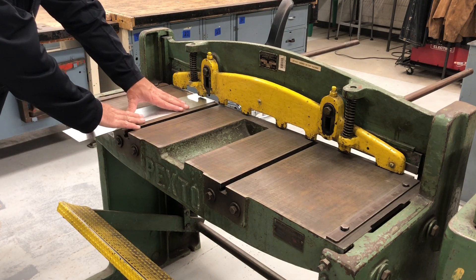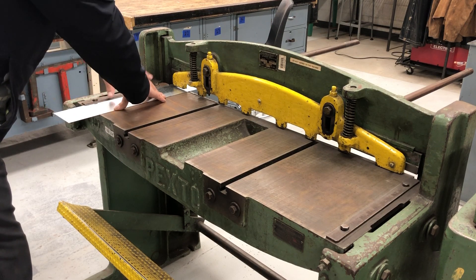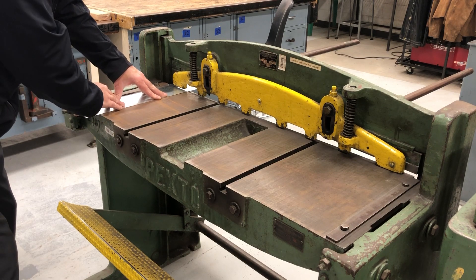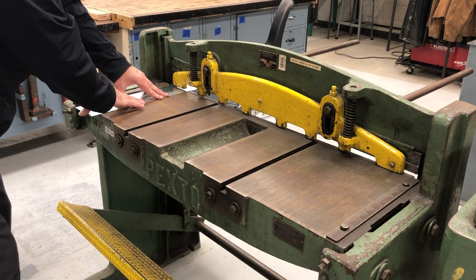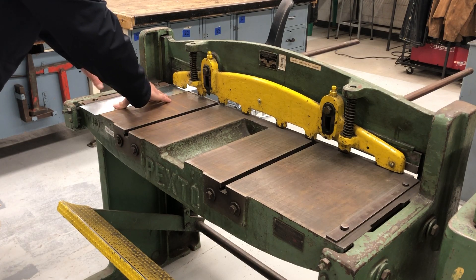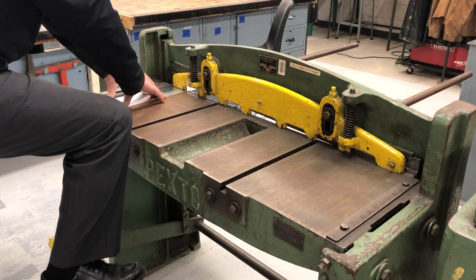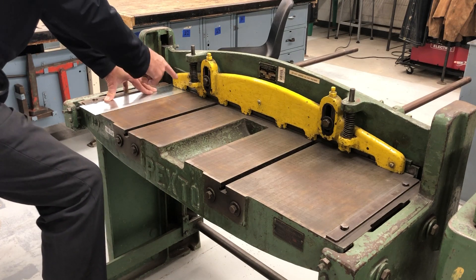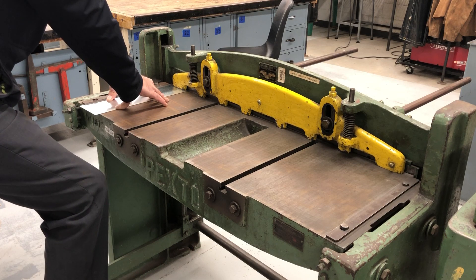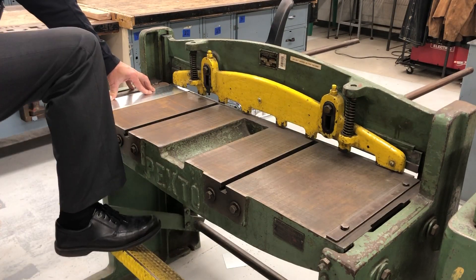When you are actually ready to cut this piece of metal, you have got to hold the metal down — slide it over, hold it down, and slide it up, keeping it against the side gauge. The side gauge is what keeps the metal square, that's why they call it a squaring shear. Press firmly down — not real hard, just firmly — and slide the material up until it stops in the back. Then, keeping a hold on the metal, pushing a little bit towards the side gauge and a little bit back, hold it down, get your fingers out of the way, and slowly bring the pedal down close to the blade. You can even just touch it, then give a firm hard press as hard as you can, making sure your foot is out of the way, and press very hard to make sure it cuts all the way through. Then lift and release the pedal.